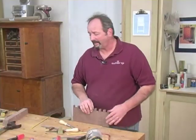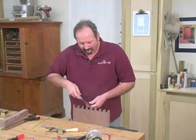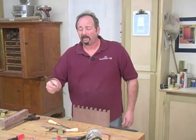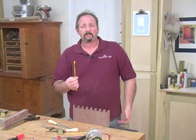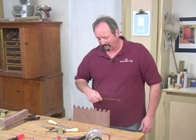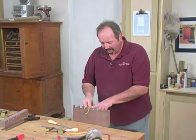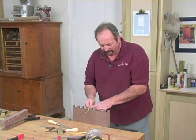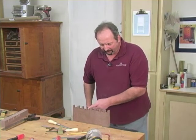How are we going to remove that waste at the side? You can't take your saw in there — it's not going to fit. And when you grab a chisel, you have to be at so many different angles it really becomes hard to do. Here's a little trick I came up with: this is a hacksaw blade. I know it's a metal cutting blade, but we're removing such a small part it really makes this operation easy. Make sure you're cutting on the pull stroke, lay it down in the socket and put your finger on top so it stays flush, then just start dragging it back and forth until that piece comes out of the way.